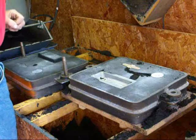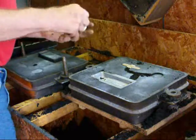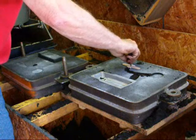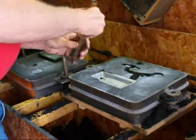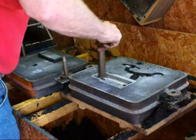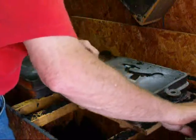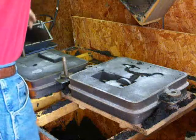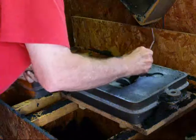Now we need to pick those patterns out. I just use a drywall screw on these little ones — that'll come out real easy, wiggle it a little bit because remember it's tapered — came right out. This little bearing support for an engine is going to pull out very easily. The other one I'm going to bang around a little bit with this brass tool — this is an aluminum pattern. Take your spoon and deepen the gates a little bit as needed.